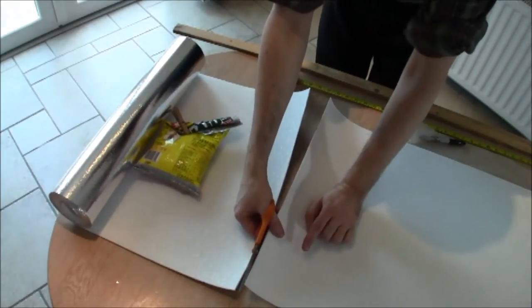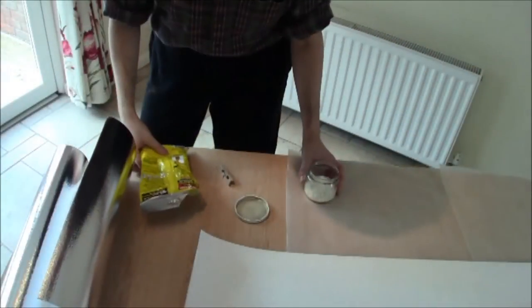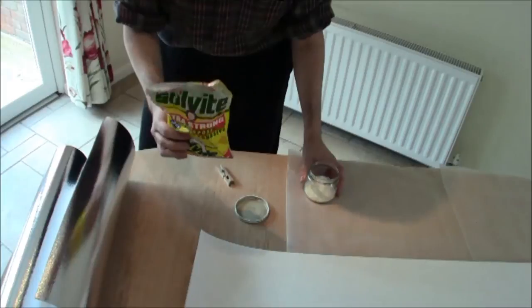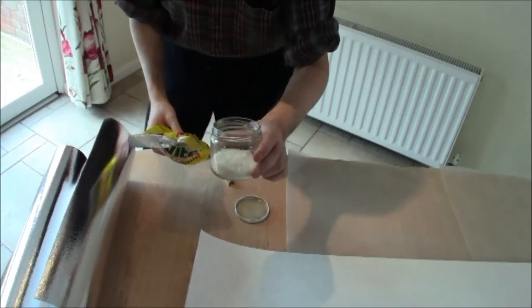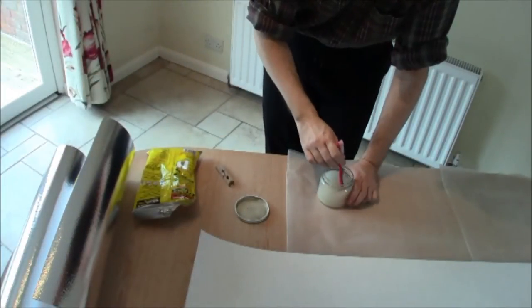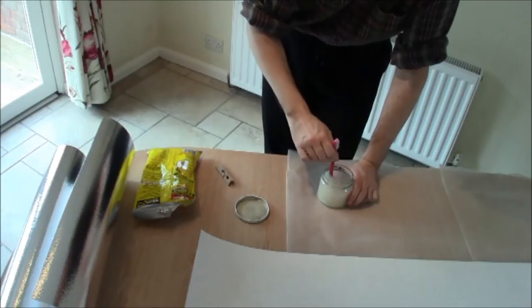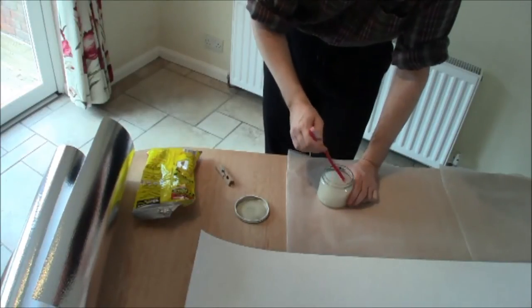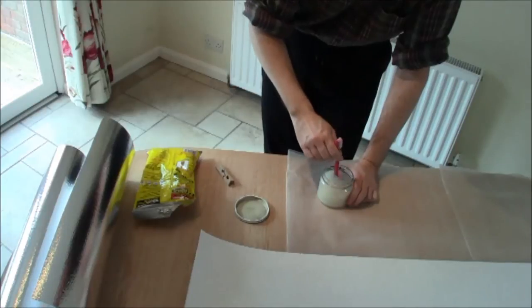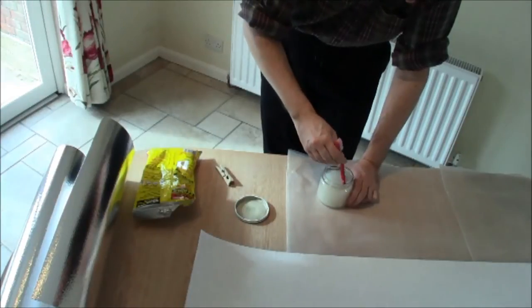It's this white surface that you'll paste and apply to the wall. Next, pour out the adhesive mix into your jar, add water and stir — just follow the instructions on the wallpaper paste packet. Very quickly you will have a paste. If it seems too thick just add more water; if it's not thick enough then add more powder from the packet.